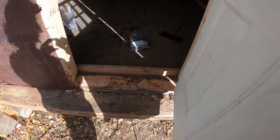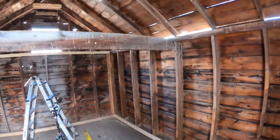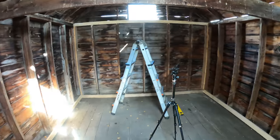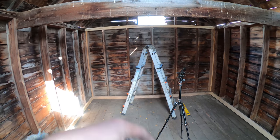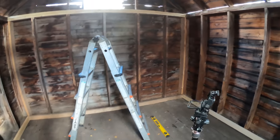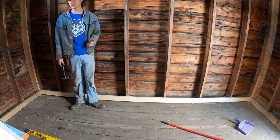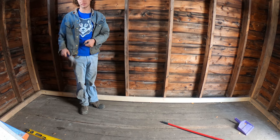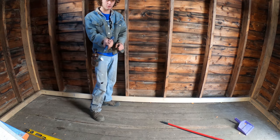It's going to be two inches more than that, and that's a nice thing to have the nice big door. I got plenty of headroom. So this is just going to work great, guys. We're going to nail her in all the way, and then go pick up the joists — the 2x4s from Grabs. Shouldn't take us too badly long. I am pretty upset about that — that was just pure stupidity on my behalf. But it's no worries, guys, we'll keep giving her. I'm going to put these big 4-inch spikes through the studs, because they're big 2x6s, then she's never going anywhere. And then I'll put 3 inches down through the bottom plate all the way around.